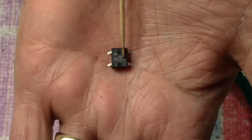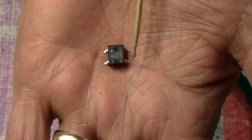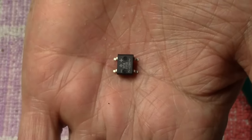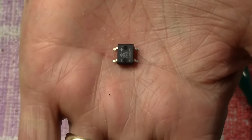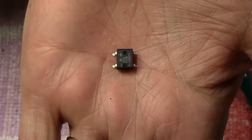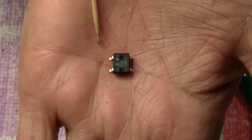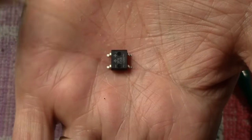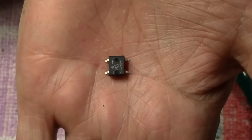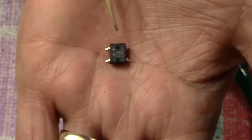This then is called a rectifier, and its proper term, this particular type, is called a bridge rectifier. And here are the inputs to it, and here are the outputs, which are clearly marked positive and negative. And in simple terms, what this does, regardless of which way the input goes into it, it will always come out the same way on the other side, which means if we use one of these in between our controller and the lighting of whatever description of LEDs, it will always work in both the forward and reverse directions of the controller, because this makes sure that it never changes over. And to keep lighting on, like in a coach or an item that you want lit up in both ways, this is the baby that will do it for you.